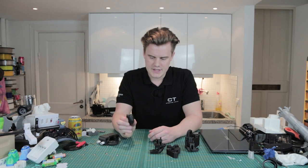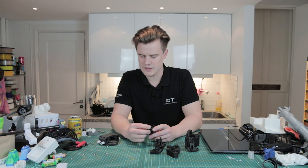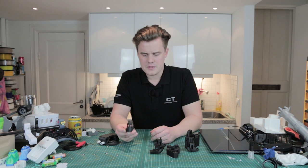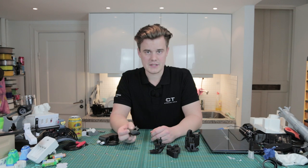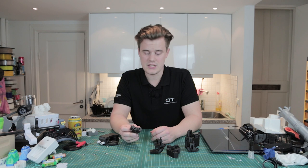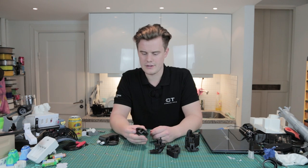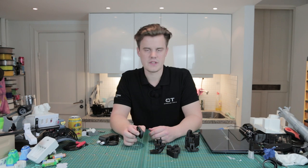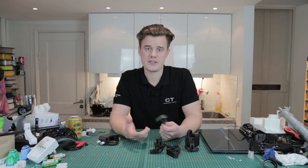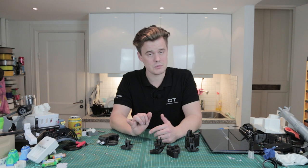As you can see I've done a lot of prints and I'm not getting them to be really perfect. I've done it with PTFE extruders and all-metal extruders — I guess it's just a matter of tweaking a little bit. I know people are getting really good results with Colorfab on Ultimaker machines, so Colorfab and Ultimaker seem to go well together. I'm guessing I could use the 3mm or 2.85mm filament in the Ultimakers instead of 1.75mm and probably get some good results.